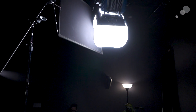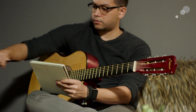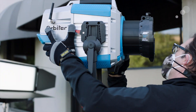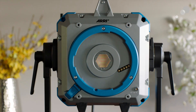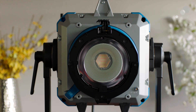What's amazing is this is all done with a very small chip that is about the size of a coin. Regarding the structure, they have designed it to be ready for onset use, so there are side bumpers and rubber feet — you can also add a skid as an accessory. The yoke is really great because it is tool-less, so when you are removing and putting it back on, it takes seconds and is completely tool-less. The other great thing is the quick lighting mount. On the front of the Orbiter it has a quick lighting mount, or QLM as ARRI refers to it, which mimics that of an ARRI PL mount.